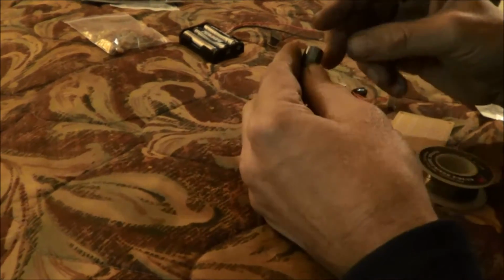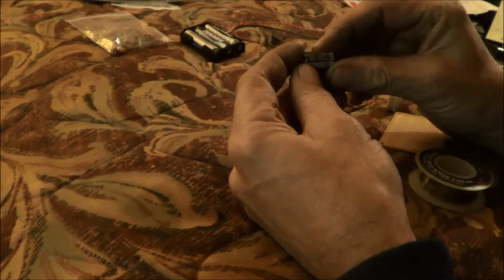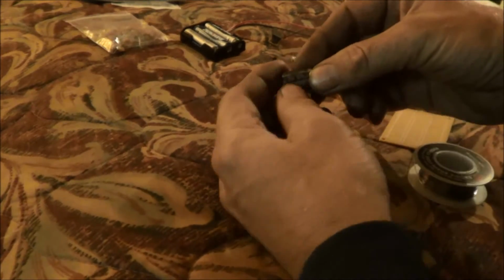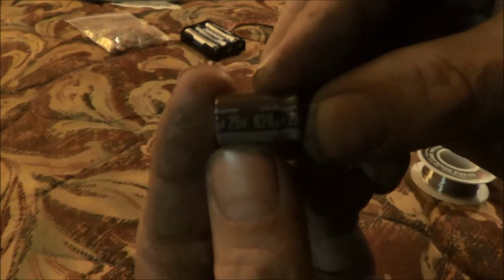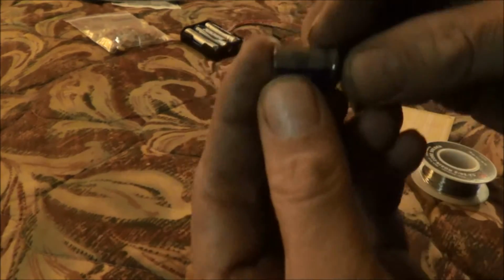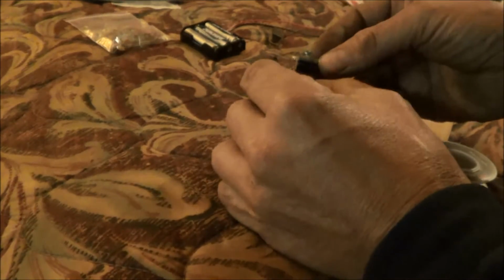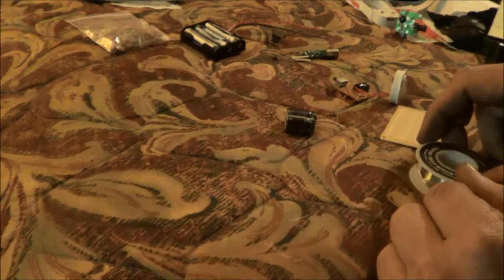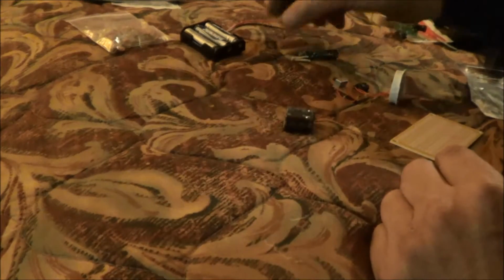Alright, I think I have the capacitors to make this work. I found an 820 microfarad capacitor in a piece of junk electronics at work today, and I desoldered it. You can see there, 820 microfarad, 25 volts, that's plenty for what I need. This one's 50 volts, 220 microfarad. I needed a 1,000 microfarad, I mean 1,040. I don't think 40 microfarad is gonna mess it up too much. Since I'm using the 10K pot, I'm sure I can adjust that out.